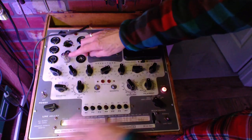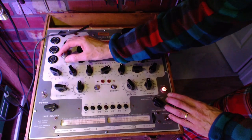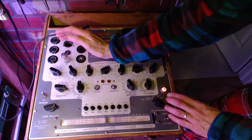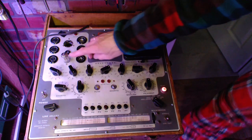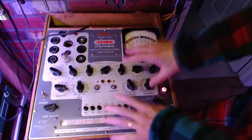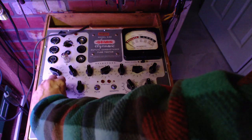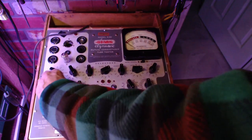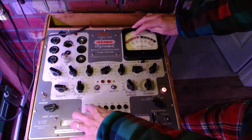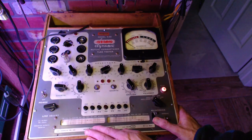So what we'll do is wiggle the tube and watch the light for a flicker. Oh yeah, the heater didn't make connection. There we are. Now I can see the 3 heaters are on. Okay, we're in business now. This says more about the tube tester than it says about the tube or the radio. So don't worry too much. Let's go with the shorts there, and now we're seeing some flashes. Very good. P1 above here. Oh, she's way above there. Way, way above. Okay, so that was section number 2.